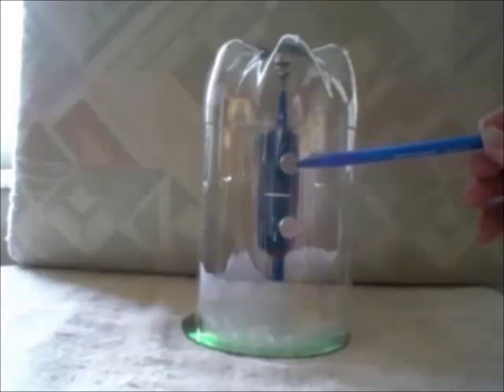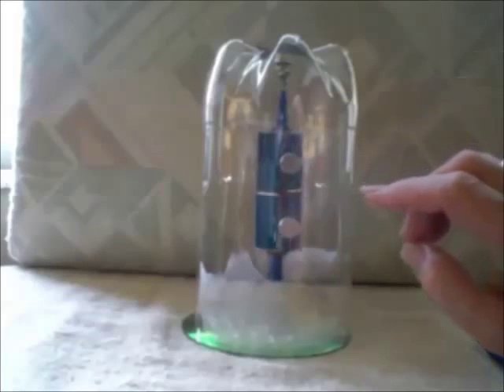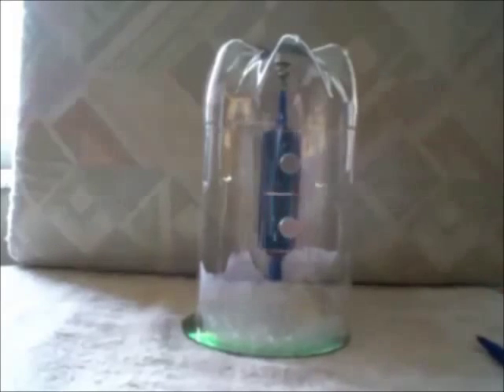The field magnets are two more flat N35 Neo magnets — one on the inside of the bottle, one on the outside. So there are two here and two more in the back. The way the field from these magnets is arranged: on this side, the north-seeking pole of the magnet is towards the center of the bottle, and on the back side, the south side is towards the center of the bottle.